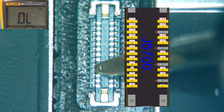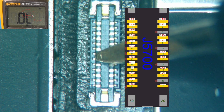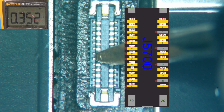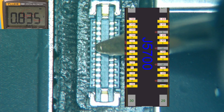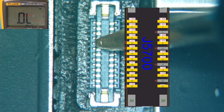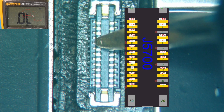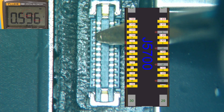This is OL, and that is correct — that's supposed to be OL. 0.332, 0.352, 0.461, 0.597. And OL is not supposed to be what we're seeing here. So that is pin 1, 2, 3, 4, 5 — we should have about 0.451 here. And we do not have the correct value. I'm gonna go ahead and check the rest of these real quick and make sure we have something. Most of these should be around 0.4 to 0.6.